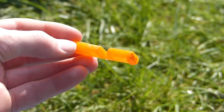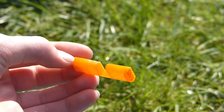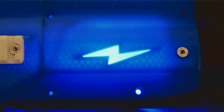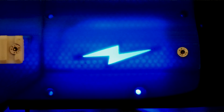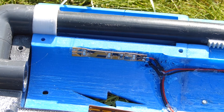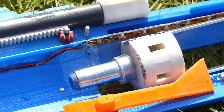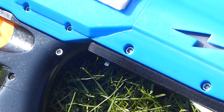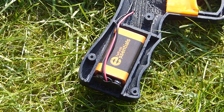A tiny nub on the switch gives the clicking sound as you move it. As a fun extra feature, there are blue LEDs which shine through the polycarbonate. Due to the lack of space, I used LED strips which are very thin and reduce the amount of soldering needed. They are activated by a small switch and are powered by a 9V battery inside the grip.